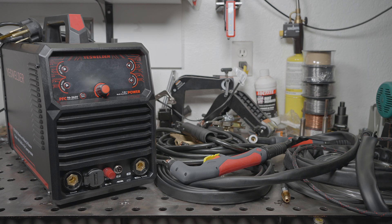The plasma cutter on this machine does have a pilot arc, which is nice. There is a sort of auto-set TIG mode for AC called AC TIG Smart. In that mode, you simply choose the thickness and the weld position, and it sets the amperage for you. From what I can tell, it's only for AC TIG on aluminum and it only sets the amperage — it doesn't apply any pulse settings, change the up or down slope, start or end current, or anything like that. It may still be helpful as a starting point, but it's no more useful than a chart with recommended amperages would have been.